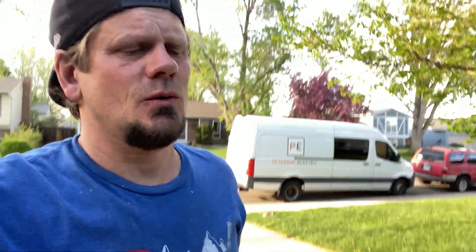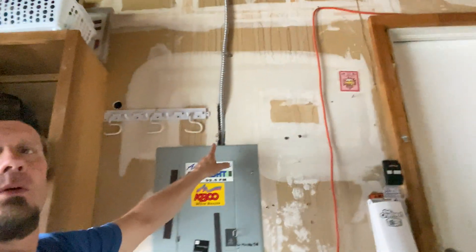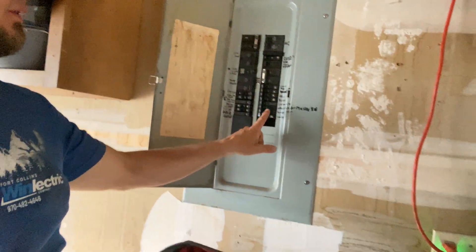That attic space and this attic space do not meet up. That's exactly why I had to use FMC through that attic, because that attic hole is right up here. And that wire had melted all the way up through there too, bubbling six times in the panel. We had to run a new piece of FMC to run that 12-3 wire in here.